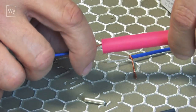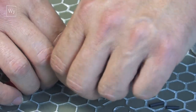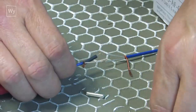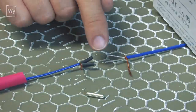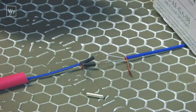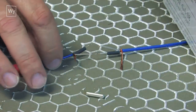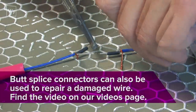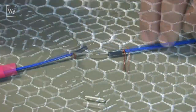We've got our wires separated. We've attached the outer heat shrink, and then I'm going to take these two little black insulators — these are going to isolate the repairs from each other and make the repair waterproof. By the time I'm done I'll have two waterproof repairs plus a waterproof repair that goes over the entire assembly. I'm going to do a solder repair — this is the best and most permanent repair you can do.